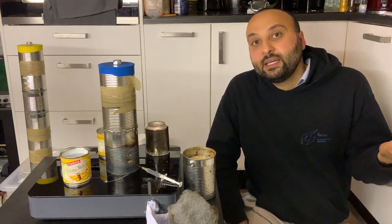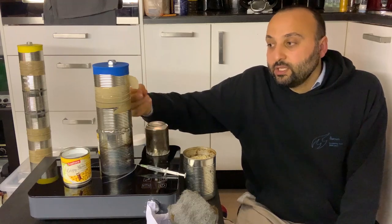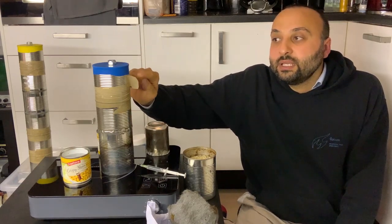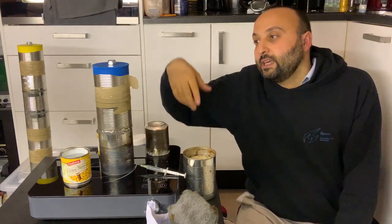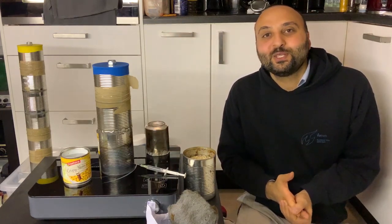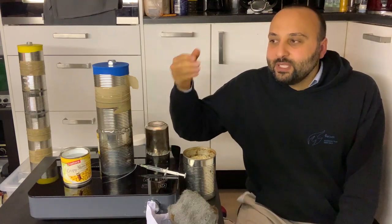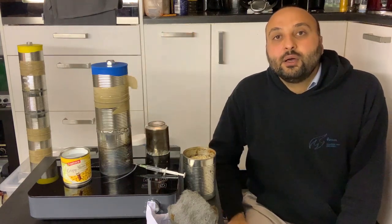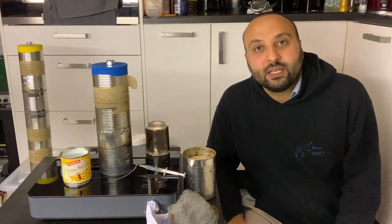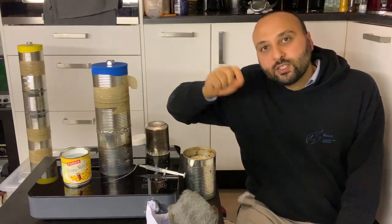To solve this issue I came to the conclusion that I should add another hole on top of the engine. When I inject the water, the vapor is created and pressure increases, but the excess pressure comes out from the top, guaranteeing that vapor stays inside the engine. At this point I discovered something fantastic — with this structure, injecting water from the lower part and having a very tiny hole on the top to release excess pressure, the engine becomes a self-starting engine. I don't need to touch the piston to start it; the engine starts from a small oscillation and eventually operates at full power.